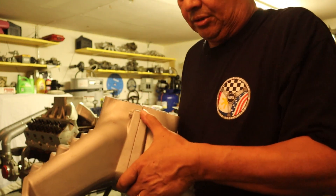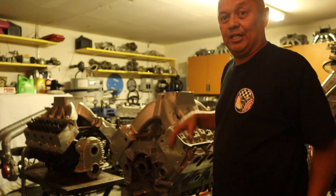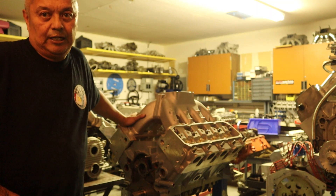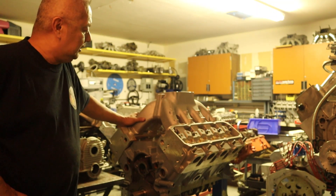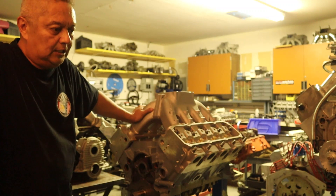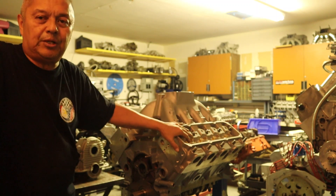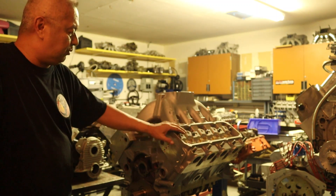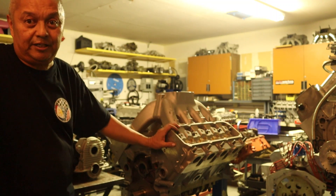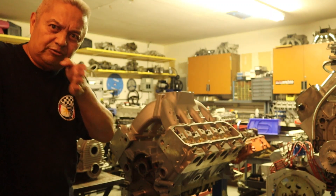This manifold iron — I bolt one half to the head and run it on the flow bench, then I can really evaluate the capability. I always like to run the heads with the manifold on — it gives me a more real-world result. The heads look impressive running on the flow bench; this one pulls about 435. Not bad for a Brodix Neal. A Blue Thunder that I did with an intake port plate runs similar numbers, slightly less, because the Brodix Neal has more of a straight intake port that goes straight to the valve.